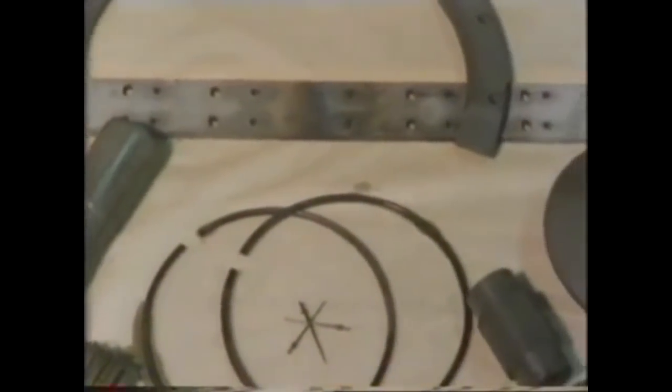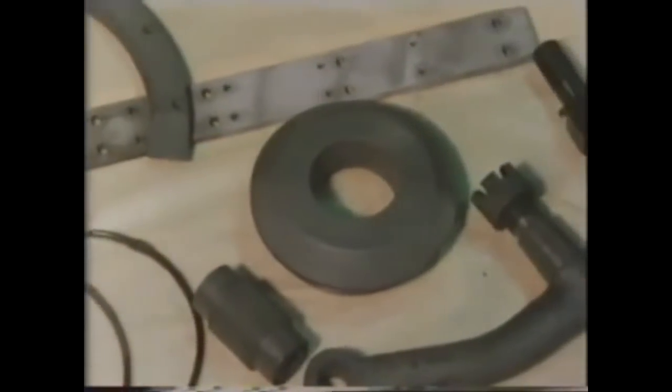But for nitriding, it's important to have special alloy steels which contain small amounts of metals like chromium and vanadium. The nitrides formed from these metals harden the surface of the steel. One of the latest techniques is called plasma ion nitriding. Ion nitriding is the introduction of nitrogen ions into the surface layer of an alloy steel component under a low-pressure, high-voltage condition. Treatment conditions are accurately controlled to produce, it's claimed, specific structures not found in normal gas or bath nitrided steels. The enthusiasts say that plasma nitriding produces more desirable results than conventional nitriding processes.